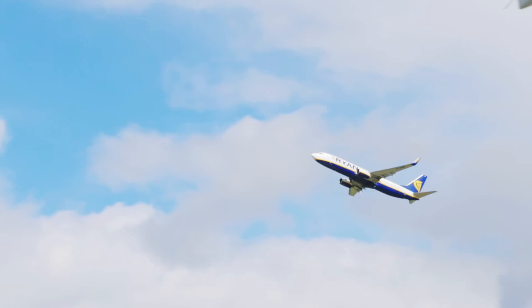It's vital for me that all surfaces are free when I come to take off. Now, if they're not, it impacts on four very crucial parts of my professional life. Lift is reduced, drag is increased, and obviously weight, because I'm carrying more weight, is increased. But probably the most fundamental part is that the aircraft stall speed is increased, and that means at the back my wings are going to drop. I'm going to know about it far too late in the day to do anything about it meaningfully, and that's the end of the aircraft.